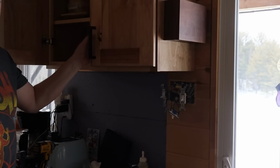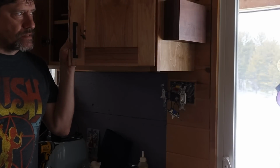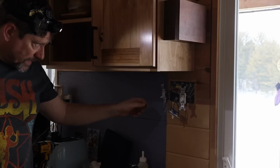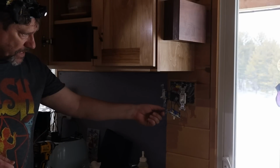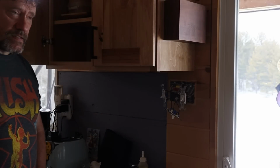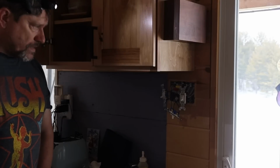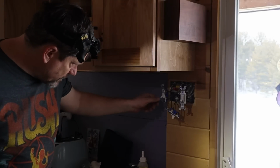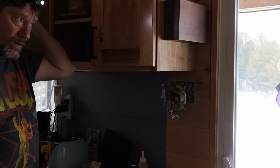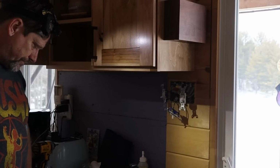Oh, so I found out that, my God, I don't even want to talk about this now. What a waste of time. I found out that the box was shorting out. I could put one lead on the box and the other on the black coming in and get 120 volts. That's not good. So I started isolating things, not thinking it all could be the new wire that I just put in. But I think what's happened is I've damaged that new wire getting it through there, and the white wire where it's damaged is hitting the ground wire, and the ground wire is installed in the box.